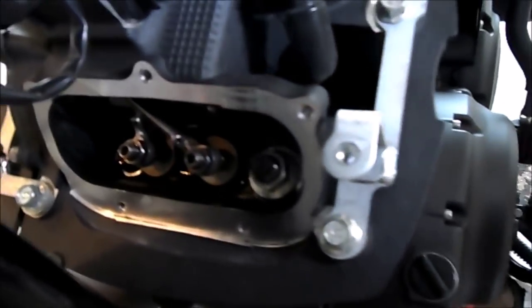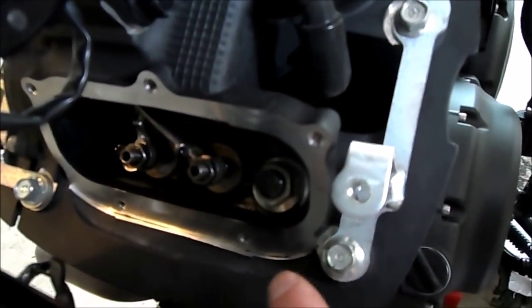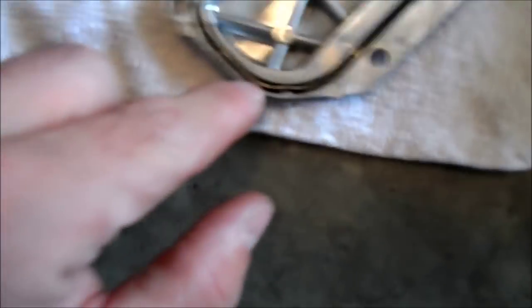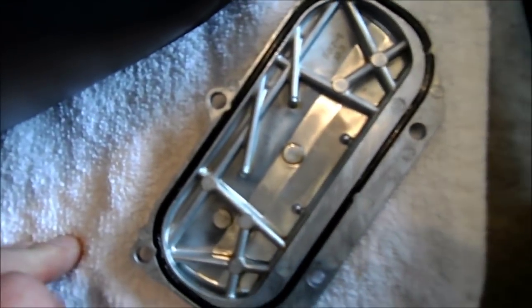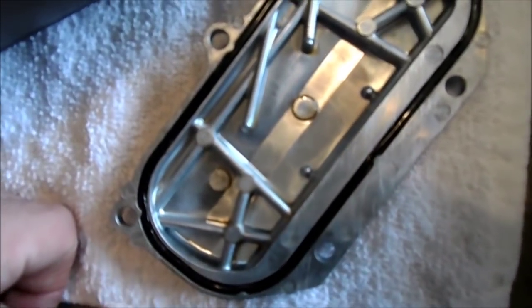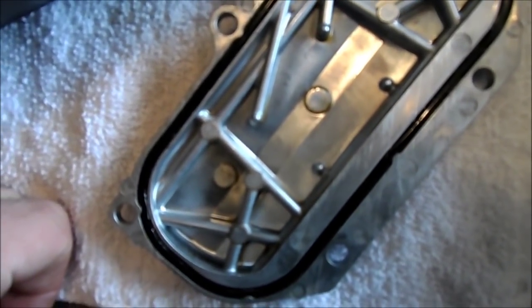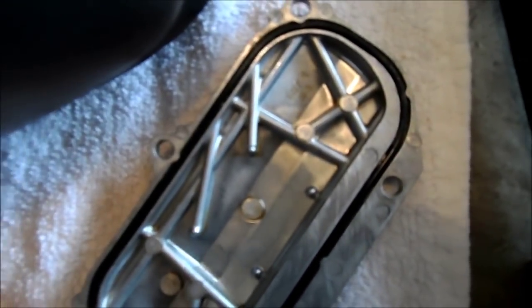I got that valve plate off and you can see there are my two exhaust valves. What you want to do is take a rag and clean the mating surfaces — right here it could be dirty. On the other side again, take a rag and clean this off. You can see the O-ring — it likes to pop out, so just take your fingernail and gently push that back in. Remember when you're reinstalling these, sometimes they'll want to roll out — don't pinch that in a weird spot or you'll get an oil leak and you'll have to do this over again.